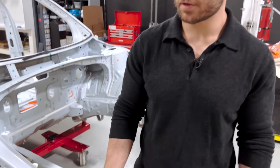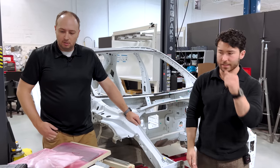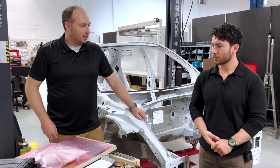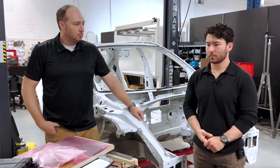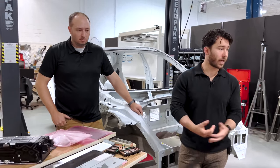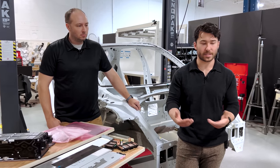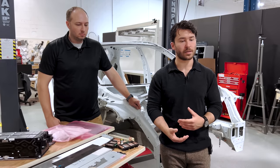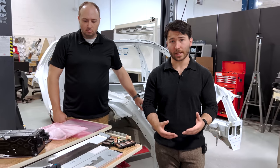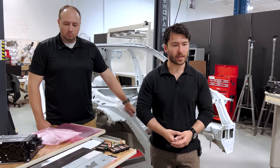We've covered just about everything. The pack is designed to be modular. Overall, it's fairly competitive in terms of design — we do see many packs constructed with extruded aluminum and stampings. The integral cold plate is one of the highlights of this pack design: that kind of integration, taking discrete components and redundant layers of material and consolidating them all into one, is exactly what we like to see. This pack design in general is really slick in some areas, and the design for assembly is probably rated quite high.